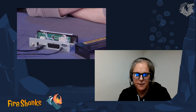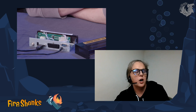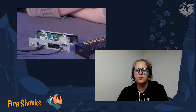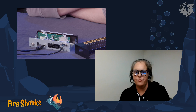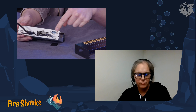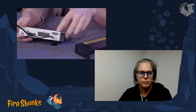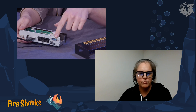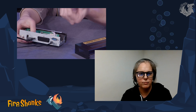One question: if you buy devices to hack them, what properties are you looking for? What could make it seem likely that a device is hackable? On this device, it's the serial port — it's very, very useful. It's a very simple way at both hardware and software level to get data into a device and out of a device, and to write interactive software and interact with a keyboard and screen.